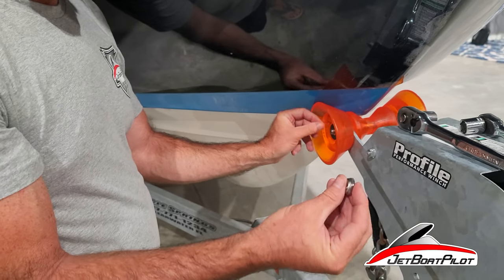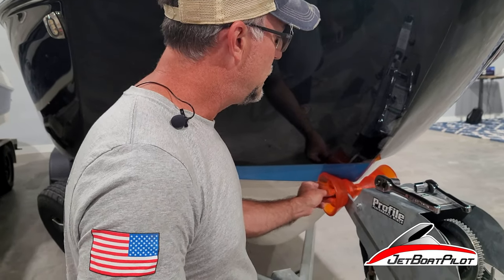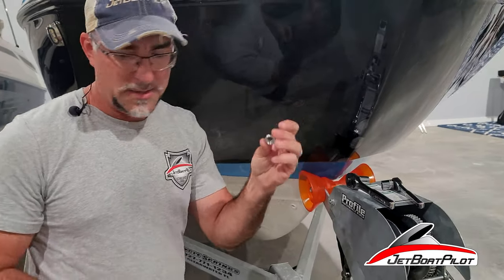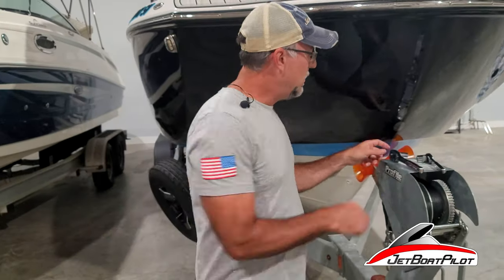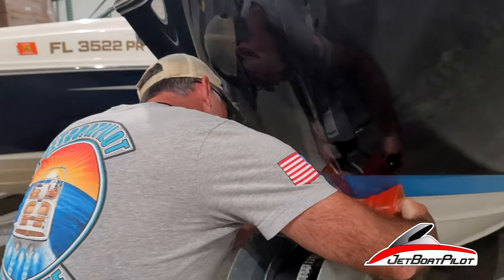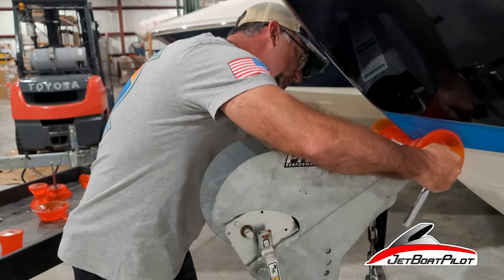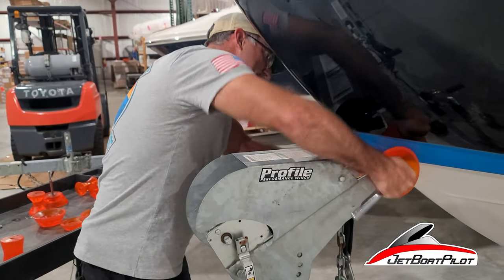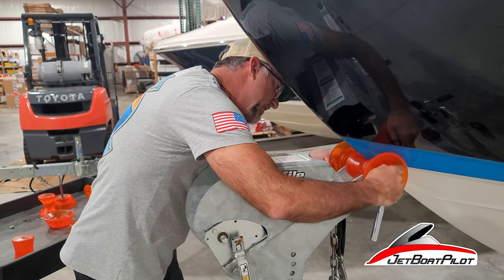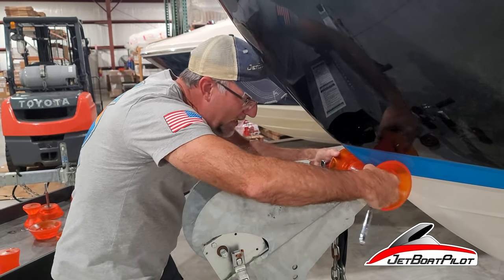This is a half nylock — it's called a jam nut. We use those now because it's much easier to get the thread to pass all the way through than with the previous taller nuts. I'm going to tighten it down with two three-quarter-inch wrenches. I want to fully engage this nut so that we have threads exposed out the back side — always want at least a thread or two coming out.